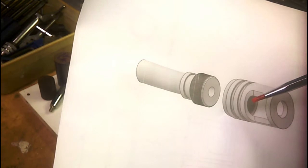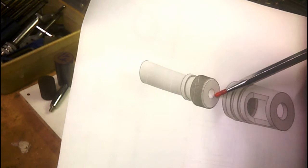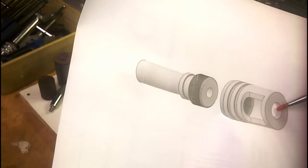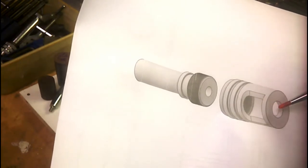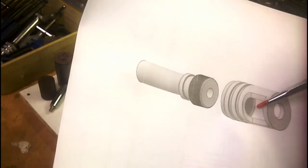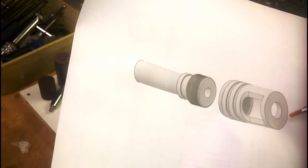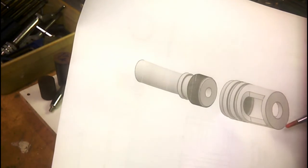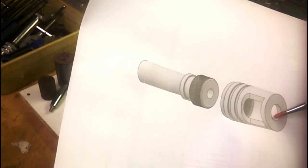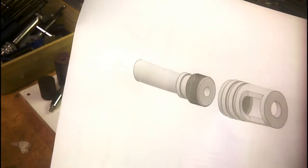the shaft, and as this portion bears up through here, it comes against the head of a bolt, which is held in a collet, a very simple collet, just a top hat section with a hole in, various sizes, and it pushes it up and holds it steady whilst the bolt, set screw, whatever, is shortened to a specified length, which is measured from this face, this distance being known as, in this case, 5 millimeters.